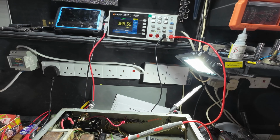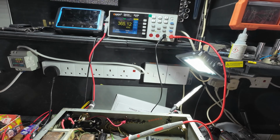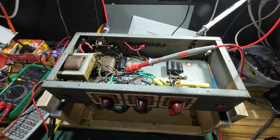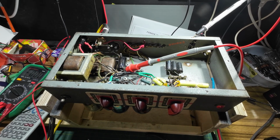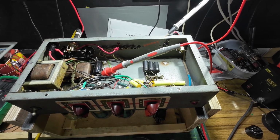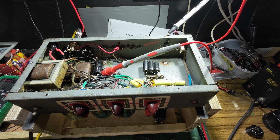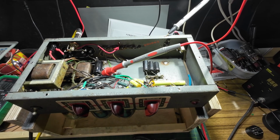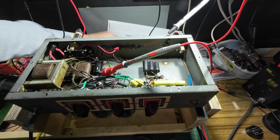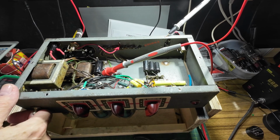You can hear that tube, it sounds like a one, and it is the output tube, I think. Sounds like a reverb tank. 19.3 watts on the nose, absolutely on the nose. Right, I've got the RCA Coke bottles in. They are very rattly, those Sylvanias. So I've got those in. And I've measured that cathode resistor while I've got the amp off, and it is exactly 200 ohms. Well, let's go again.